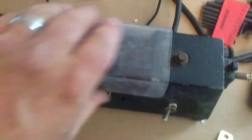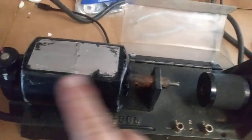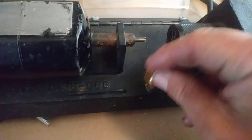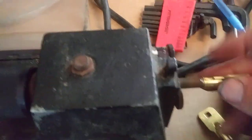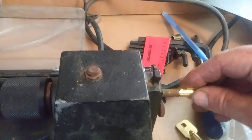I'm going to repaint this and redo it, and I'll do another video once I'm done. The shield is a little fogged up — I'm going to probably put a brand new shield on it. Now the Scotsman — this is actually the Scotsman HPC bottom mount. The HPC is identical to this except it comes with one more collet. The collet refers to the size of the key. That number two is the standard size that you use. The HPC added one more collet — a smaller collet. So I'm going to order the smaller collet, tap it, and put it on here. There's also an indexing wheel — you don't need it, but it goes on here and allows you to look at the number on it when you cut. So I'm going to order that indexing wheel also.